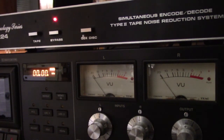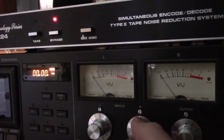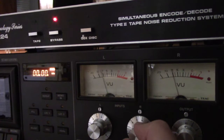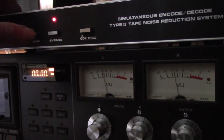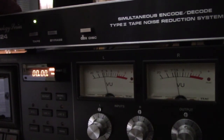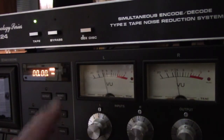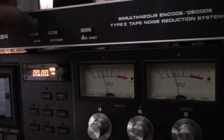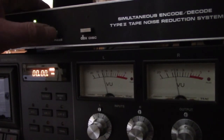I'm going to start the music. With the settings here, you have to have your output level all the way up. Start with the DBX bypassed — so you get your needles bumping around minus five. Then you take the DBX and turn it on, and you want that to be bumping at about minus five too. If it doesn't, go to the back and turn that little blue record dial until it does start bumping at minus five. Then you've got your unity gain. You know you've got unity gain when you can jump between tape and bypass and the volume doesn't change — the levels are the same.